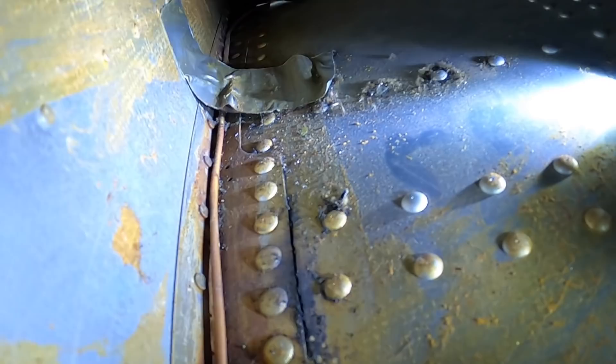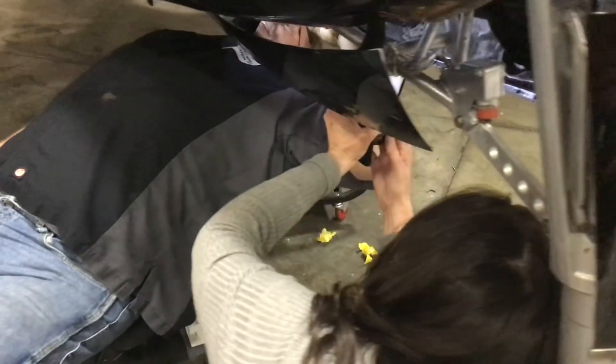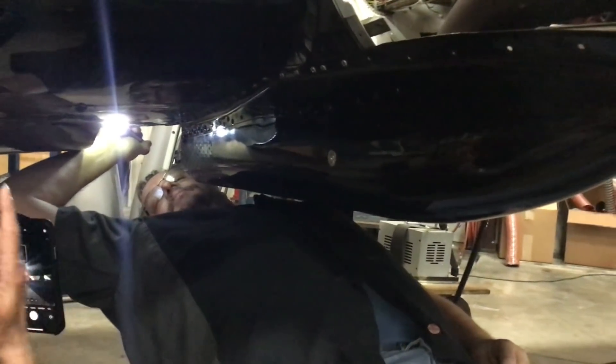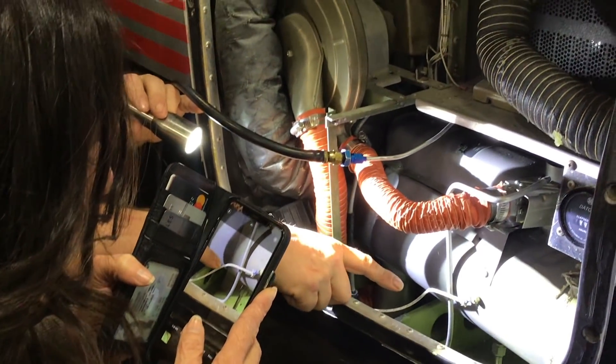On further inspection of the landing gear wing skin cracks, looking up in the nacelles you can actually see the crack for the wing skin — it's cracked on both the left-hand and right-hand sides. We're going to have to remove some landing gear components to put a beef-up kit in there. TAS set up a video conference to show me the side brace cracks on the main landing gear, cracks on the wing skin on top of the wing, and some corrosion they found in the nose.